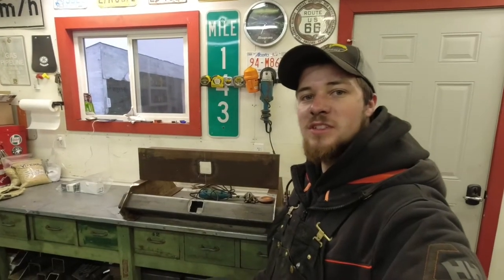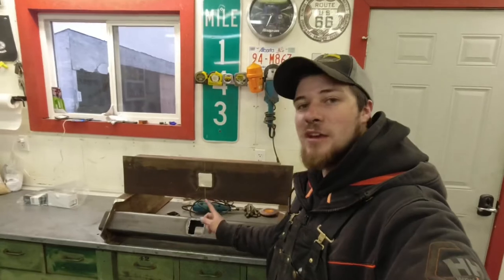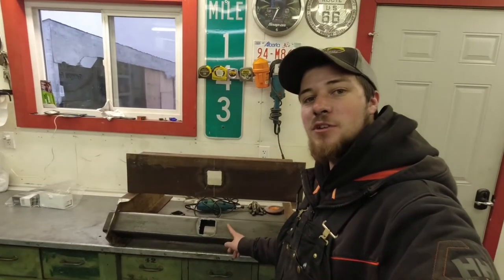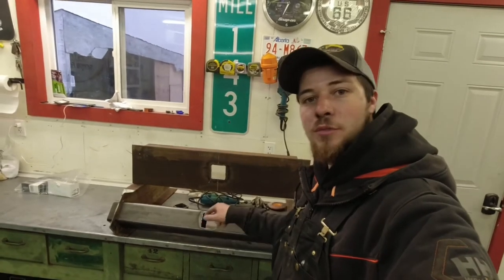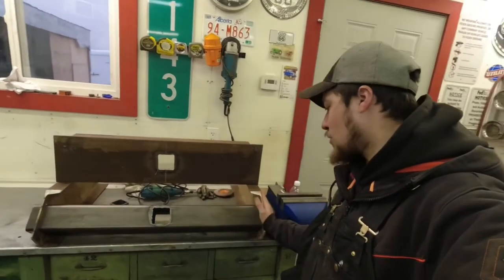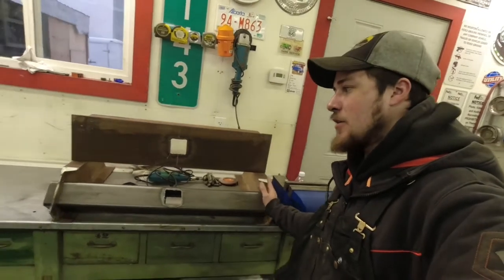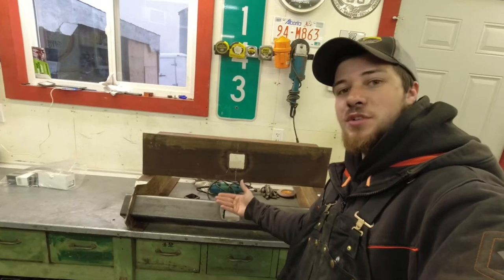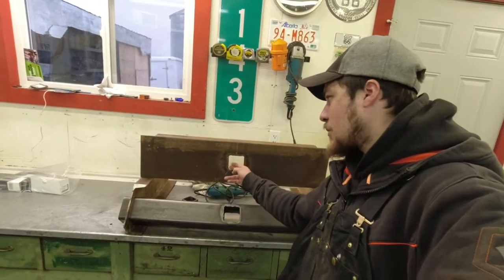We just got those pieces all cut out for that hitch. We got the 4-inch, quarter-inch thick tubing. We've torched a hole through both sides of that. And then this is the front faceplate that's gonna go across both sides from side to side here. And then it'll also have the receiver tubing sticking out past here.